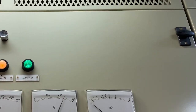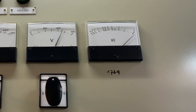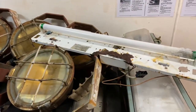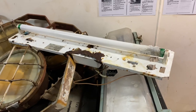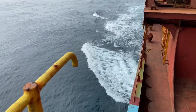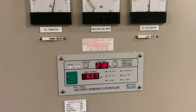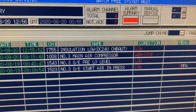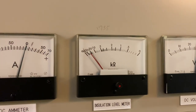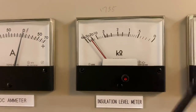My technique is to drop off all the breakers and then switch them back on one by one. But of course, it would be a different case if you have a fault in your 24-volt system, because in the 24-volt system you cannot just simply drop off the breakers, since critical and essential equipment are connected to it.